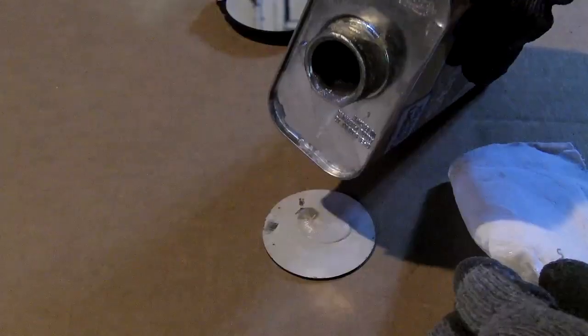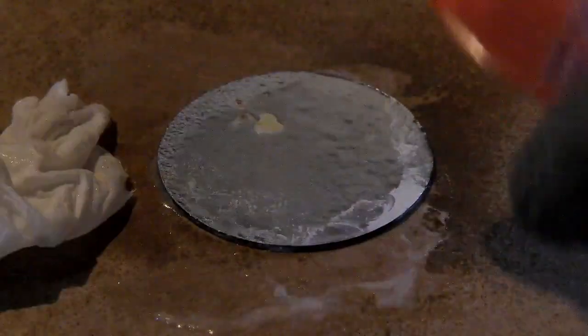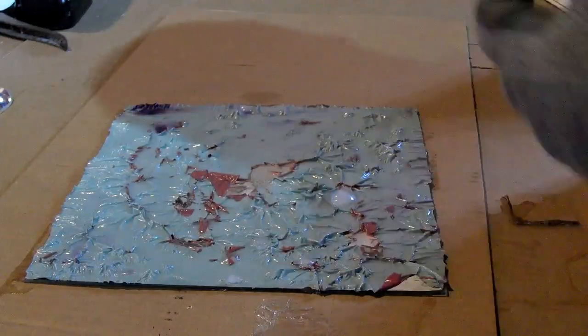Pop it out and add some paint stripper to it. Once the aluminum becomes apparent, spray a little bit of the mixture with the orange peel oil and wash with clean water. You now have an awesome first surface mirror. For larger mirrors the process can be a bit messy and require up to two hours of strip time. This is how you transform a regular mirror into a first surface mirror.